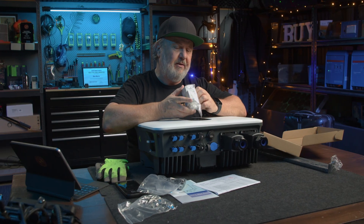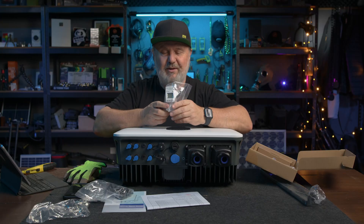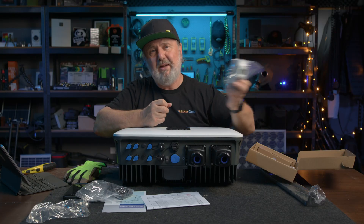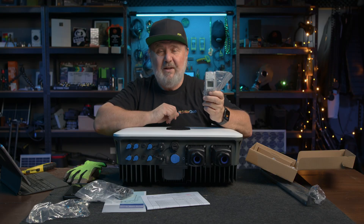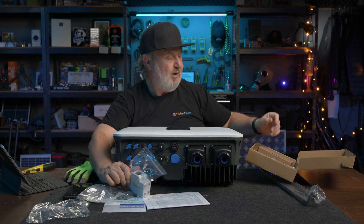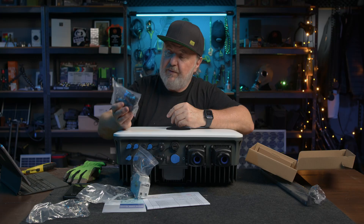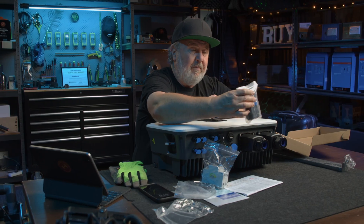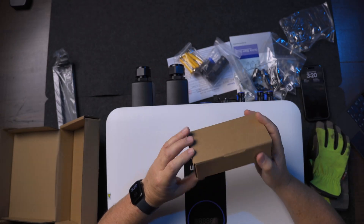And an energy meter. As soon as you've got a hybrid inverter and you want to understand your self-consumption, you need a meter. On top of that you need this meter if you want to support loads — it goes upstream on the grid side of all your loads. Hopefully you can get it up at the main switchboard and run comms cable back to the inverter. It can then tell the inverter whether you're about to export power or whether it should start charging the battery instead, or conversely when you're importing at nighttime use the battery to displace that imported energy. This little meter is pretty critical to the whole process.